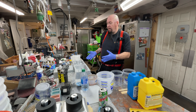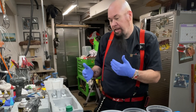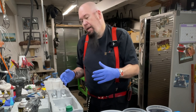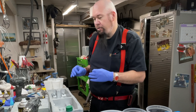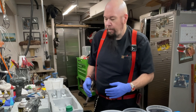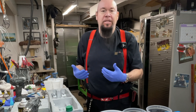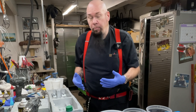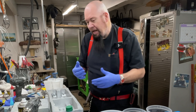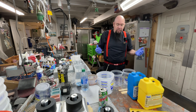One of the byproducts of using the aluminum powder is it helps as a demolding agent — you've got this powder between the mold and the material so it helps loosen it up. Another thing it helps do is fill gaps and pop any bubbles. That's another great thing about using cornstarch, baby powder, or any kind of talc like this: if you get a tiny little bubble or a little bit of foaming out of your material, it'll kind of fill that in. The other cool byproduct — the reason we're using aluminum — is it bonds to the material better than paint. What you end up with is a part that looks like it's actually made out of aluminum, and even though we're going to paint it, if the paint scratches you've got a nice weathering underneath that looks like real metal.